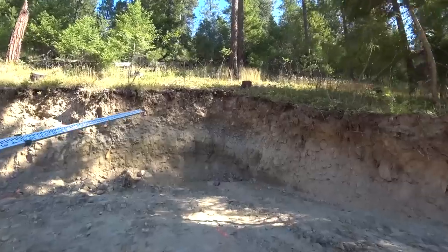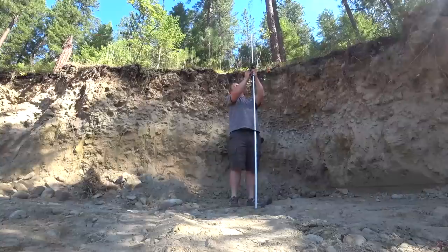We've got to do a little bit of measuring out here to determine exactly the number of blocks that we're going to need because we're going to be doing a step down footing. My engineer wants to be sure that we've got enough drop from the location of the rear bathroom to the septic tank. So I've got to do a few leg steps this morning to help get the plan ready. So the bathroom is going to go in this corner.